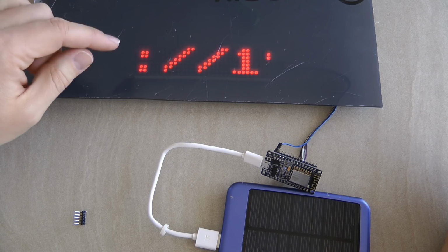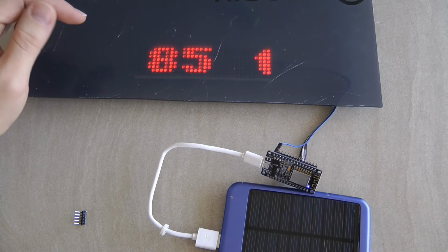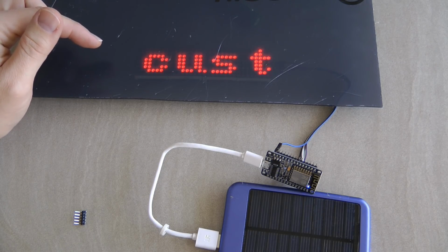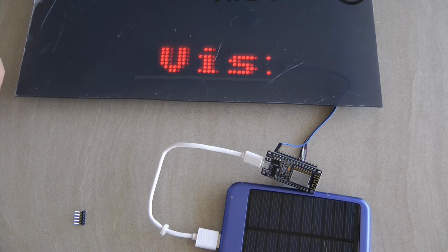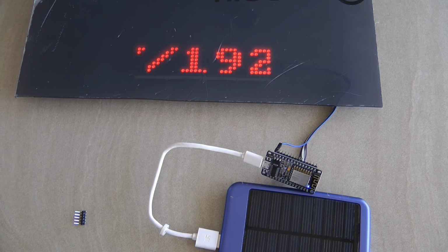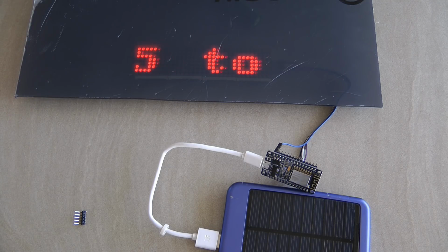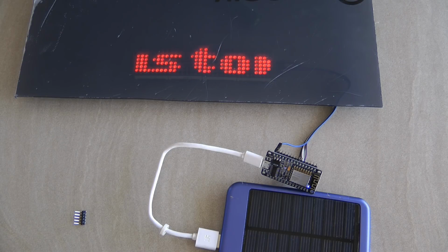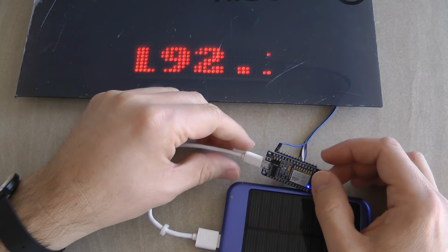And by the way, I've written the code in a way that instead of using DHCP, it uses a fixed IP address, because that would be just easier to know which IP you need to connect to, instead of it hopping around. But even if you choose to use DHCP, at least you can see the initial IP on the screen. So once it boots up, you can wait for this text, go to the website and start making changes. And so, as I said, really simple.